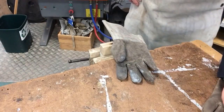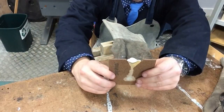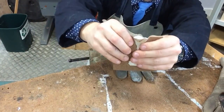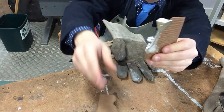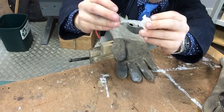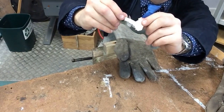Next I'm going to show you how to take it apart once it's cooled — it should take about 10 to 15 minutes to cool. All you do to take it out is push it out like that, or you may have to break the mould like this one. Snap the mould and then you will be able to finish it — file it and cut the sprue off on the top using a hacksaw.